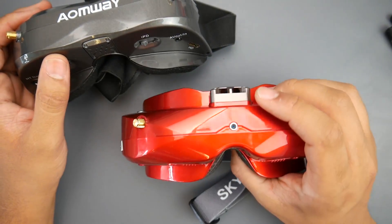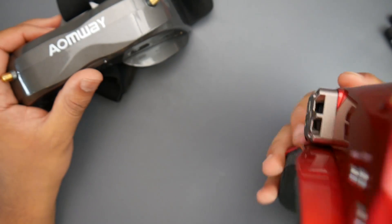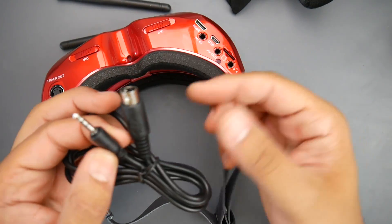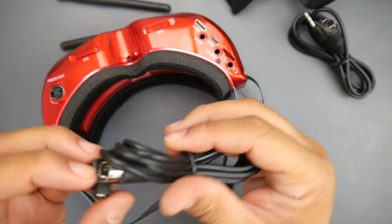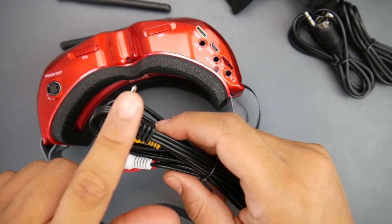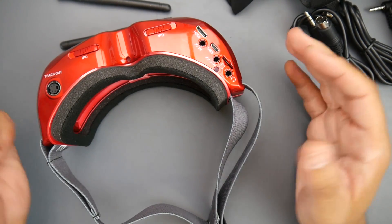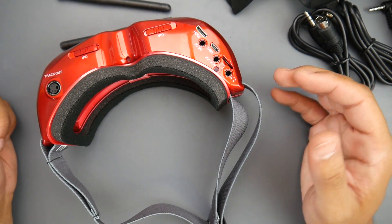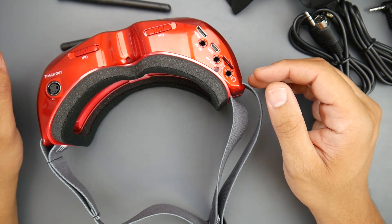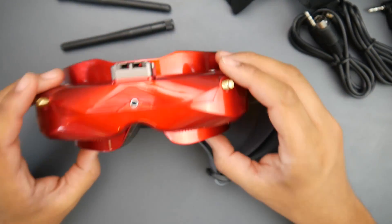Customer service and support I also give to Skyzone. I really like what they've done here — they've kept it at roughly the same price and made nice modifications. They provide a lot of accessories: two dipole antennas, a head tracking cable with connectors for FrSky and another transmitter format, an RCA to 3.5mm adapter, and an XT60 power cable. The voltage range is 7 to 24 volts, so you could run it on 2S up to 5S. I personally wouldn't go above 4S, but the flexibility is really nice.